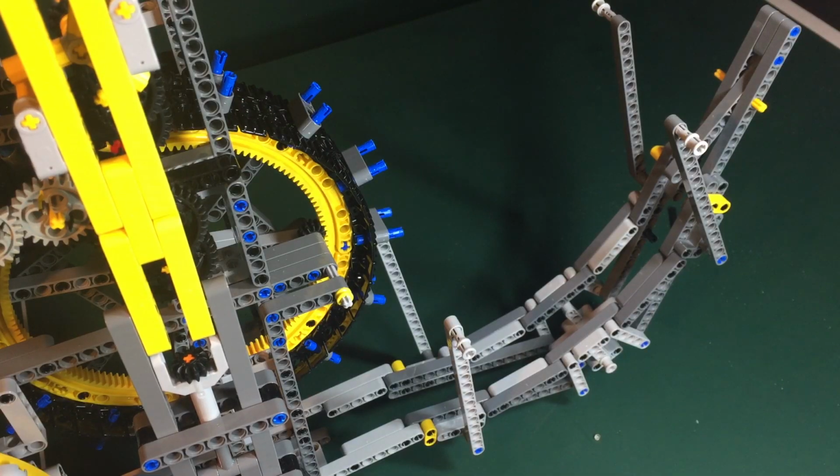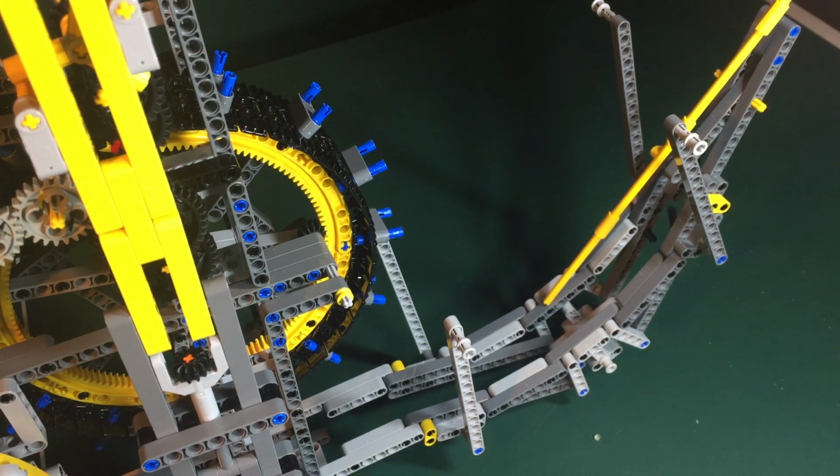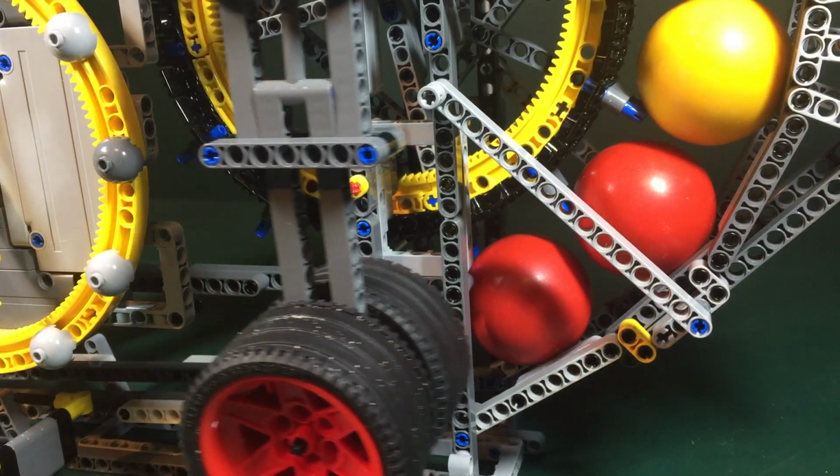The bracing struts you see are there to stop the weight of the balls on the wheel from pushing the rail and wheel apart. The track itself is continuous inside the guide, and as the balls slowly rotate, they transfer their weight from the ball blockers on the wheel to the rail system in the ball guide.